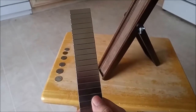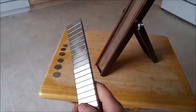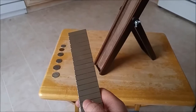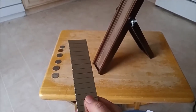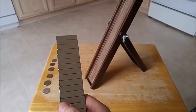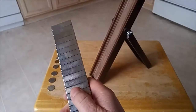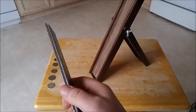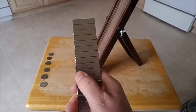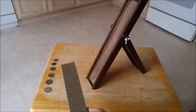The type of magnets used are neodymium magnets, otherwise called rare earth magnets — they're the strongest commercially available magnets. These particular ones are N52, and that number is a relative strength of the magnetic field. The range goes from N34 to N52, so these are in theory the strongest type. Of course, magnetic strength is also based on size; these are pretty thin, rectangular-shaped magnets, and I selected that shape intentionally.